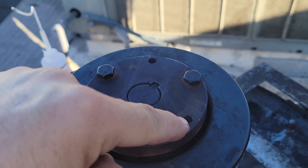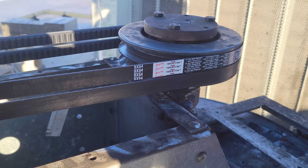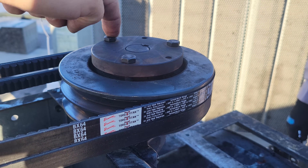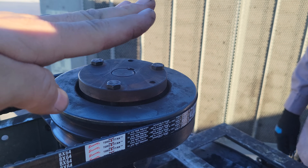There are threads on the taper — that's to separate the pulley. The other holes don't have any threads. So we had it where we wanted it, lowered it just a little, and now we're going to evenly tighten these — quarter turn, quarter turn, quarter turn, quarter turn. You don't want to do boom boom boom boom all at once, because it won't align itself.